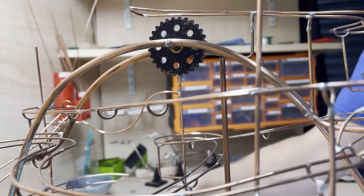And often I use a whole bunch of clamps, you can see that here, and sky hooks and everything I can find to hold things in place whilst I do all the work. But it worked. The helical spirals just work. They're lovely things. When the copper's too large for soldering, then I now switch to brazing, which makes it a lot easier. It can get a lot of heat in with a flame. And at the top there, you can see I've built in some fine adjustment to set the spacing correctly between the balls and the vertical track.